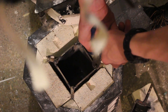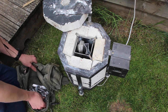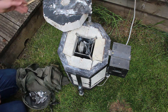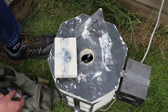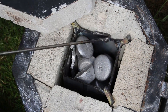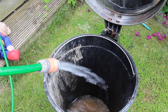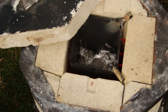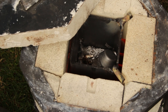This crucible is so much bigger than the last one - scrap aluminium just fits in without being cut or crushed, which is much more convenient. One downside is it takes much more energy to heat up - probably four or five times longer than the old crucible to reach aluminium melting temperature of around 700 degrees Celsius. Overall it took about two hours to melt all of the aluminium. I didn't have a specific project yet, so I just wanted to see what I could get in the crucible and poured it into a bin full of water. All of my scrap aluminium only filled the crucible a third of the way.